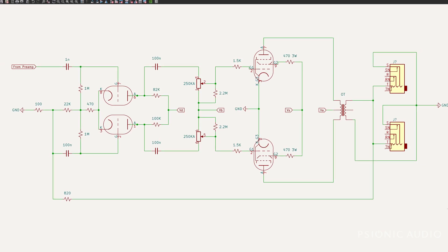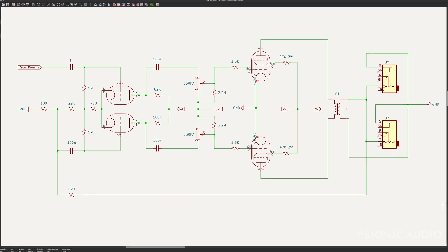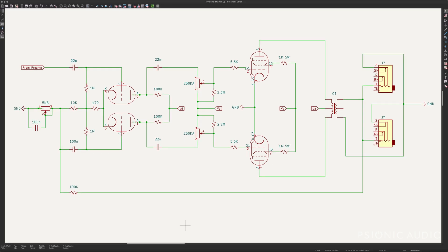The complication comes when you have an amp with a presence circuit — like here I've shown a Marshall one. Not only does the negative feedback circuit collapse just like it does on the other one, but that collapsing negative feedback is much more audible because your presence goes away. All the highs that you dialed out with that presence circuit come back in all their glory, so it can be a little bit fizzy at lower volumes. Again, nothing's perfect, but this is a very good, musically useful option.